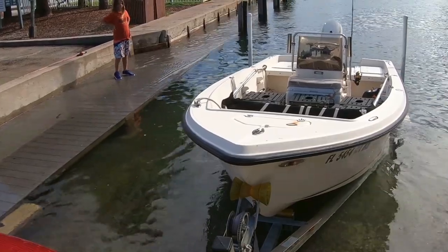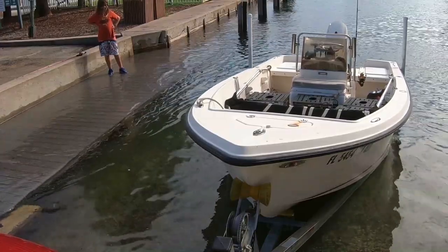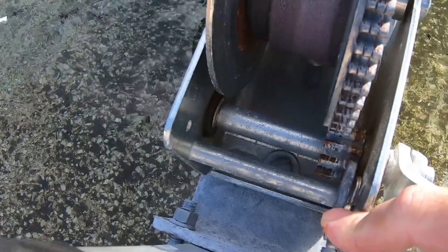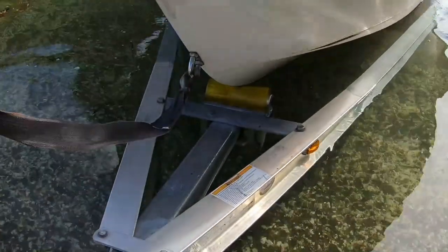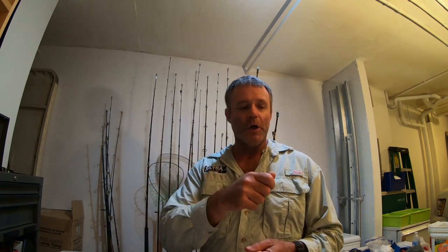As you back down, watch how far you go. Back the boat into the water slowly until the stern just barely floats — just barely lifts up off the back end of the trailer. Then get out, unhook the safety chain from your boat, and loop it back on your trailer. Disengage the click lock on the winch to put it into free spool, reverse it, and let the boat slowly glide back into the water. It's not going to drift off — it's still lodged in place on the runners, but it will seem like it's floating. Then hook the strap back onto the winch safety chain loop and hop onto your boat.